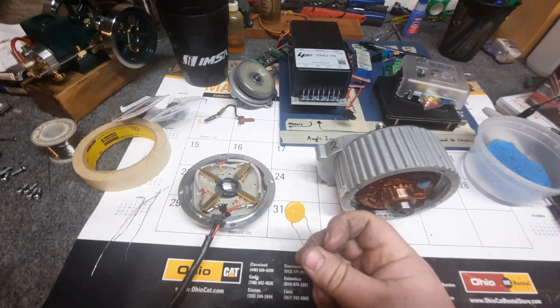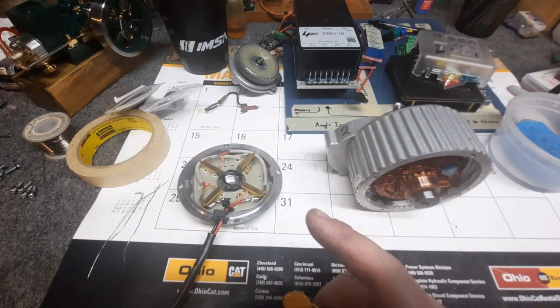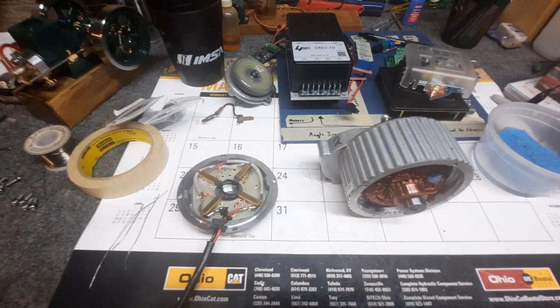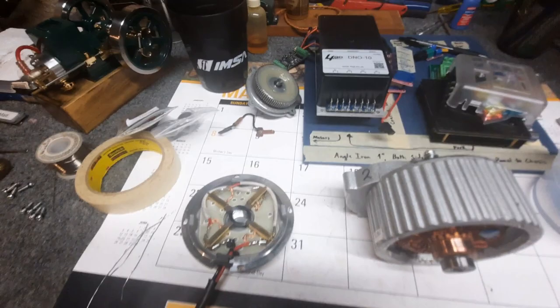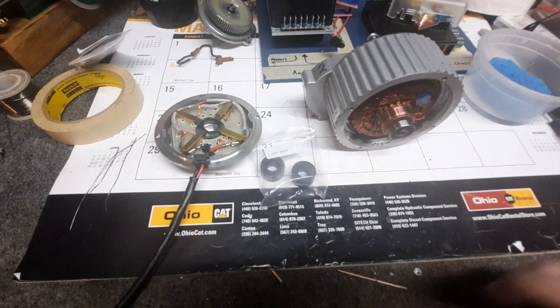One of the reasons why I chose the 4QD product over the Dimension Engineering ones is that they do an amazing job on their website of explaining this concept and many of the other features and thought process and engineering that's gone into this controller. And I'll link those videos down below. They did a heck of a good job explaining that. They have nice fancy oscilloscopes to demonstrate the signal and how much noise this capacitor and adding these, technically ferrite beads on the motor lead wires, do to suppress that noise.